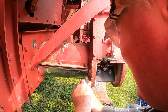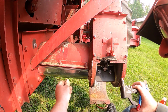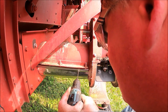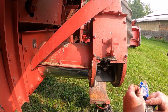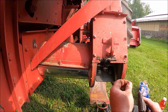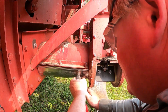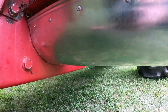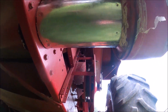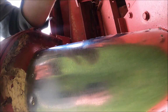Should be plenty of clearance between the auger flighting, that shouldn't bother the pop rivets. I'm using very short rivets. These are 1/8 by 1/4, I think. And when they pull in, they get smaller yet. Hey, here's my repair right here. Put the piece of ducting over the auger and pop it on. It should seal the grain in there.